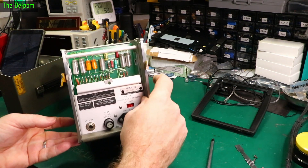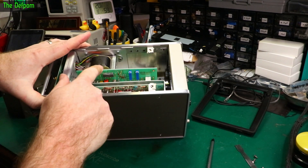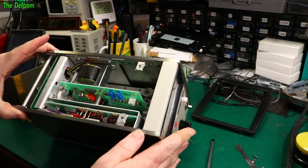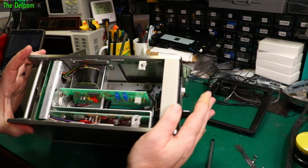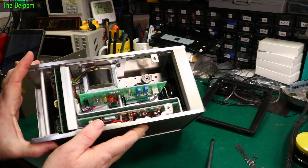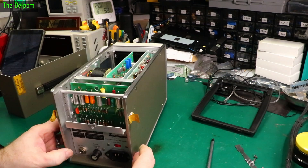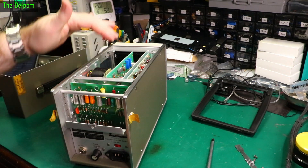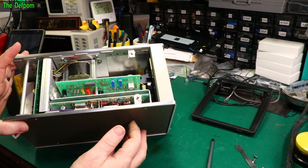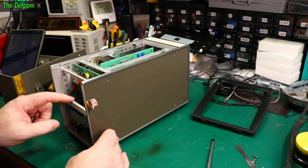Power supply board looking alright - it's got a more modern transformer in there, and it's got the new version of the board which is what my board is based on. Looking nice and clean. It's interesting the way the digital board looks newer than the power supply board, because it's got newer style caps. The power supply has some older ones - like Sprague style. So it's the newer version of power supply board, toroidal transformer version. And the chopper board is the newer version as well. That's everything I was expecting - and it looks pristine inside.